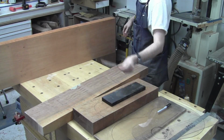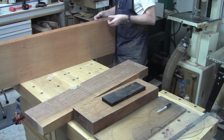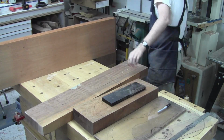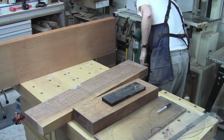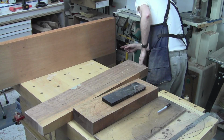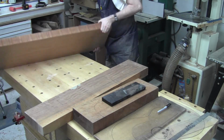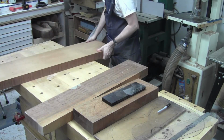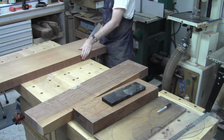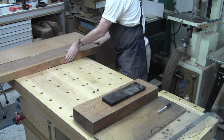It's a little skinny for a headstock. I'm going to probably have to put some wings on, which is fine. It's not a big deal. But in the end of it all, I have to find where the grain lines run again. I believe we're quarter sawing down in here. So that's what we'll do, is we'll probably quarter saw here and use that as our neck, just take a slab off of that. So that's all the big pieces.